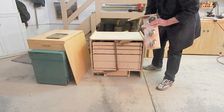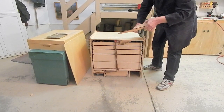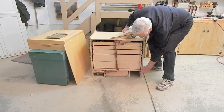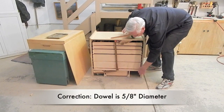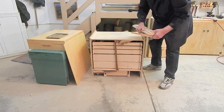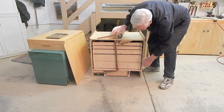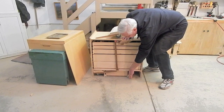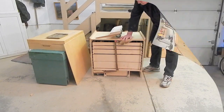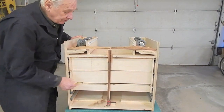Here are the caster assemblies — three casters per side, double thickness of 18mm plywood, and an actuating arm which pivots on a half-inch dowel nailed into the corner between the side and the floor of the cabinet. The caster mounting boards and the caster assemblies are contained between the sides and an intermediate wall to form a box at each end of the cabinet.